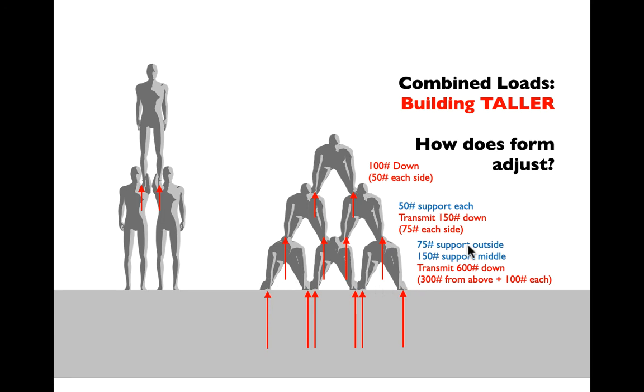Triangles are good structural shapes because they are geometrically stable. To change the shape of a triangle, you actually have to bend or break the elements in a triangle. Whereas with a square or a rectangle, you can make many different parallelograms out of 4 legs that have a fixed length. Triangle, you can only make one shape. So a triangle is stable.